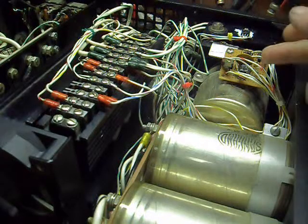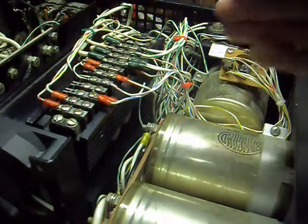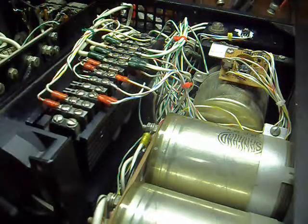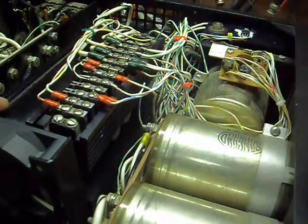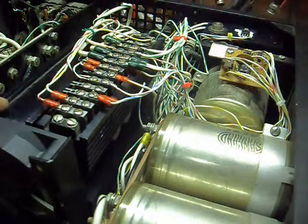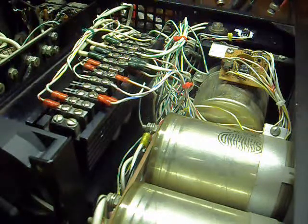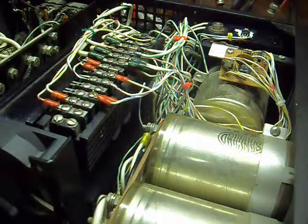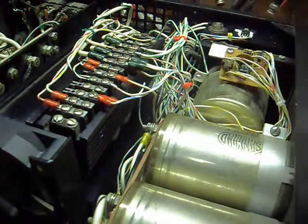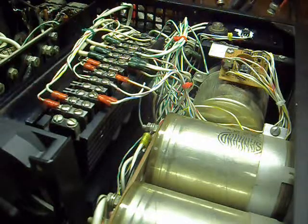This circuit is designed to fold back the current as the output voltage drops to 0. That is of course to limit the power dissipation of the shunt regulator, because if you maintain 20 amp continuous current at the full bank voltage, which is around 30 volts, you'd be dissipating close to 600 watts in the shunt regulator, which would be even a bit much for the transistors I have in place to take. So I have it tapered down to around 10 amps at 0 volts output, and it goes up to a full 20 amps at 24 volts, and it's continuous current output,